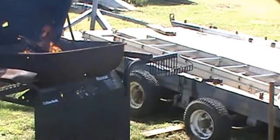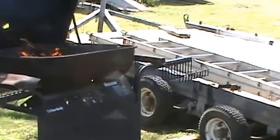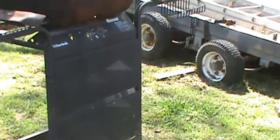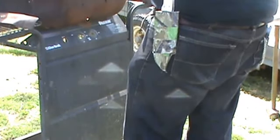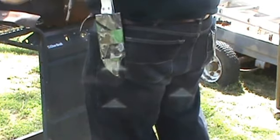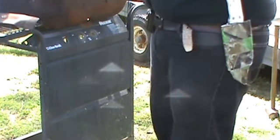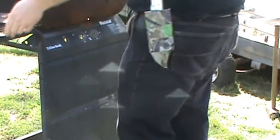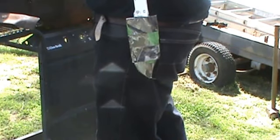See what we got here. All right, I think we got it on the forge. But are we recording? Yep. All right, TB's back here. I'm going to see if we can make a machete today. Straighten out a carbon steel knife that I started the other day. I had to reheat and temper it. Straighten the back edge of it out. It's got kind of a bend, like I say, right here in the back of the blade, which makes it stick.